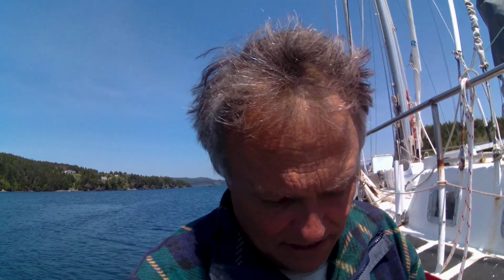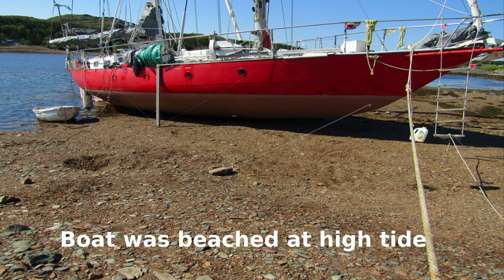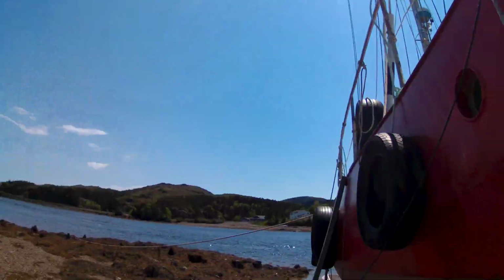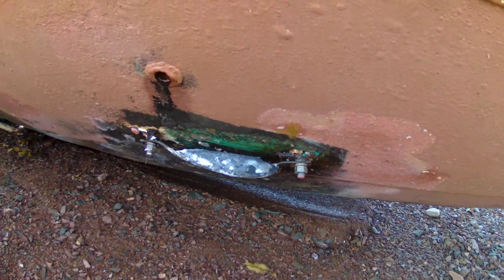And then just welding around water. You're dealing with electrical currents, so you got to think about that too. So this is not necessarily a recommendation. This is what you do in a remote area if you have weld-on anodes like I do. Actually, I have a couple that are bolt-on, which are a lot easier to change. Like that one's a bolt-on anode.